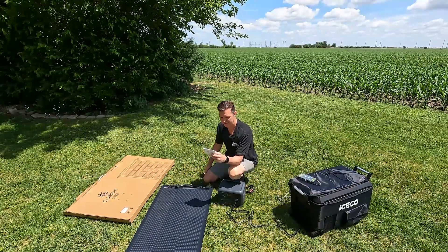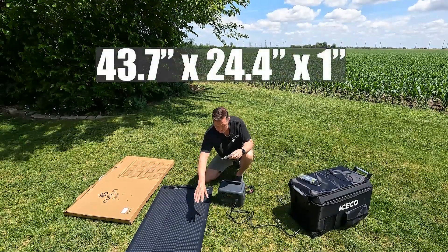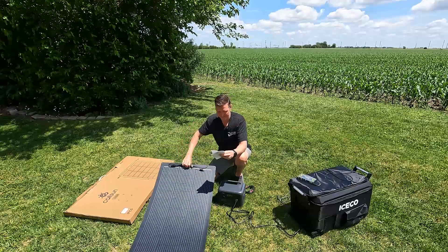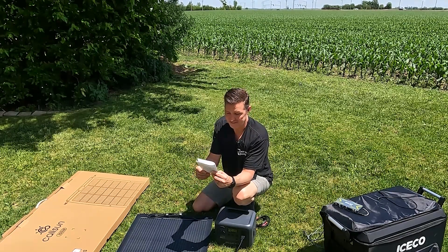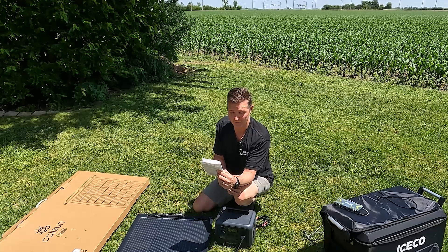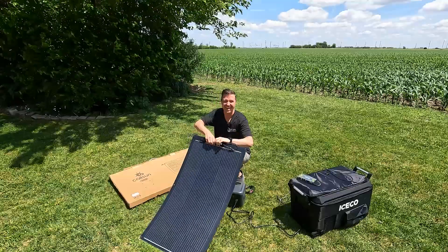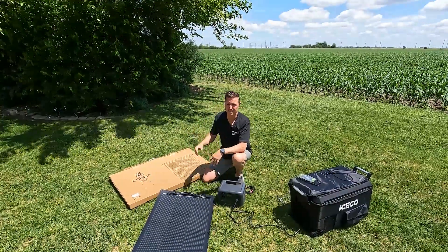The dimensions are 1111 millimeters long, 620 millimeters across, and about 25 millimeters thick at the top, give or take two millimeters. For the electrical specs: maximum power voltage is 18.6V, maximum power current is 5.39A, open circuit voltage is 21.17V, short circuit current is 5.9A, maximum system voltage is 600 volts, and max overcurrent is 10 amps. All of that information is also printed on the back of the panel, so you don't have to worry about keeping that manual safe.